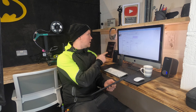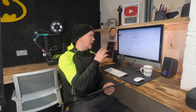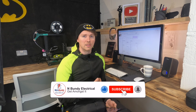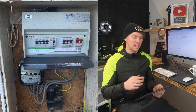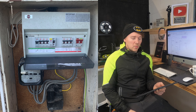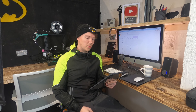So the first picture is a fuse board - an outside cabinet, which we've fixed loads of times. There's nothing greatly wrong with that nowadays. But for this one, there was. So it's a 16th edition board, with one RCD covering the main socket circuits in the property. Standard, not a lot wrong with it really.